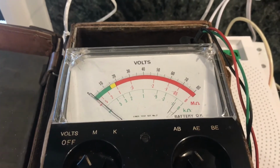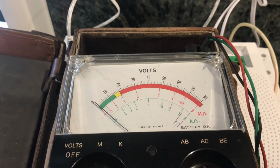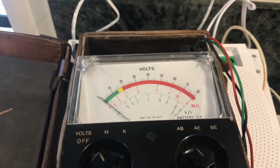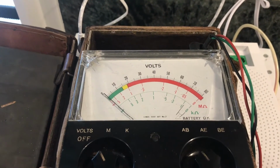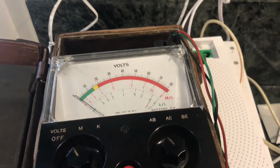Basically the customer is directly underneath the MDF, so the cabling from here down the stairs is probably only about 30-40 metres, and the exchange is a couple of k's away. So it's dropping out, an intermittent fault. It's definitely not an internal cabling issue. Telstra, this has got to go back to you.